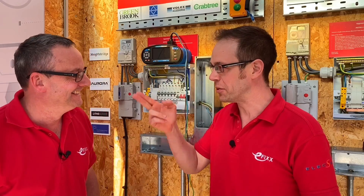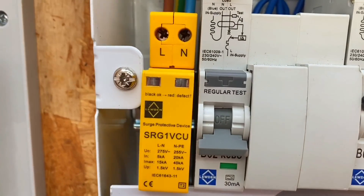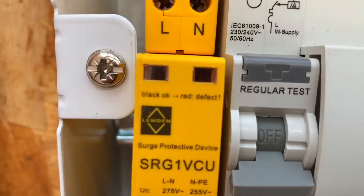I can't help but notice Gary you've got your glasses on, so obviously today is going to be a very technical presentation. What are we going to cover in this video? We're going to look at Type 2 SPDs and is there anything we can do as electricians to prove they're actually working? That's an interesting question, because generally we fit an SPD and return occasionally to look in the window to see if it's been activated. What we're going to do today is show that you can actually test to see if the SPD is triggering at the voltage that we expect it to.